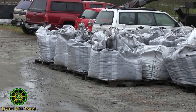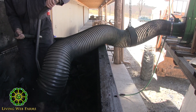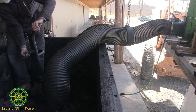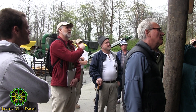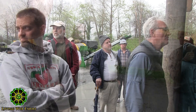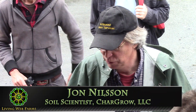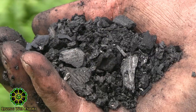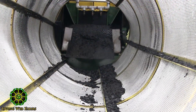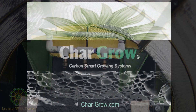Question: So you grind it up? Yes. It's basically pulverized by the impeller. It's also sprayed with water before it hits the impeller, so that cools it down and keeps the dust level down so we're not losing a lot of our biochar to the air. Question: What's the moisture content, given the little bit of water from the nipples and the spray? We shoot for about 25% — it can go as high as 50. Basically you need enough moisture that the material is stable. When carbon is finished it's kind of volatile — we've cooked off the volatile compounds, but it's bone dry, similar to lighting a backyard grill. So we need the moisture in there to stabilize it. And then in our next step of the process, we're adding more moisture when we charge the pore structure on that char.